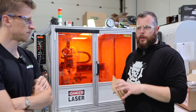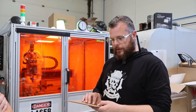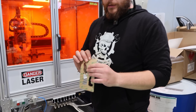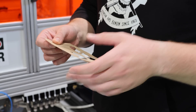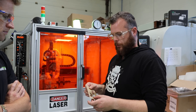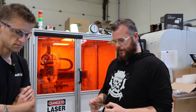We're a little bit hesitant cutting paper because of starting a fire, so we're trying to figure out the right rate to produce the least amount of smoke. We're also cutting into glue, and that glue layer in the middle is potentially flammable, so we have to be careful with the speed. We're only doing one at a time to dial it in before we run a full sheet for safety. We'll probably have a CO2 extinguisher here and ready, just to keep everybody safe.